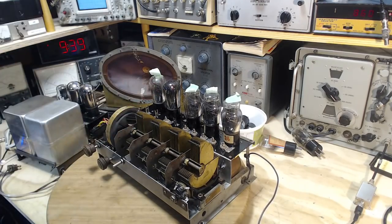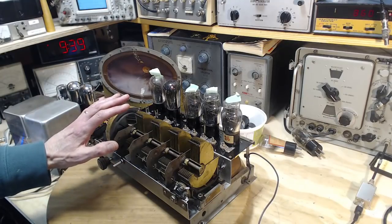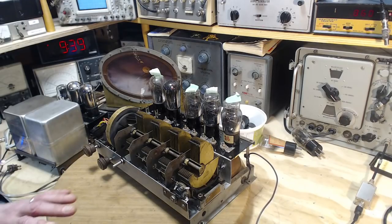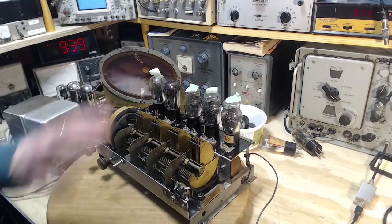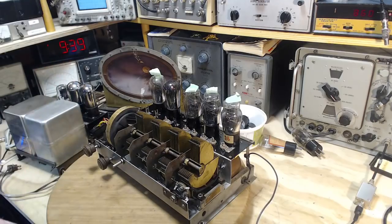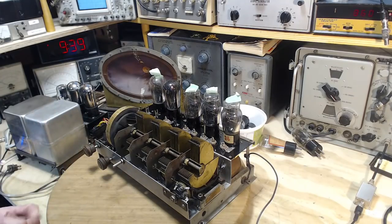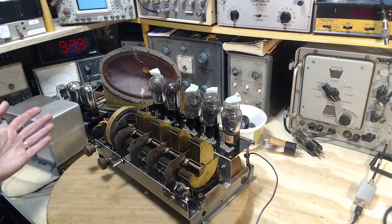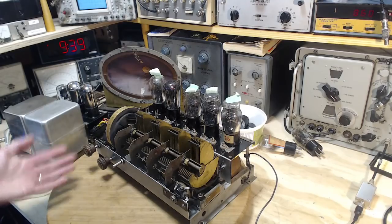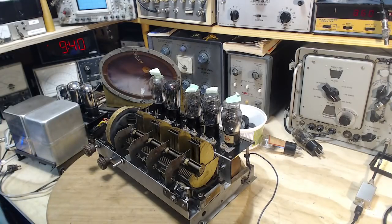So I have this radio plugged into an isolation transformer, which means it has no electrical relationship to Earth, to the ground, to everything that's connected electrically to the Earth, which is the entire electric grounding system. This thing has no relationship to it, but it's a radio receiver. It's designed to be affected by signals. So a really interesting question comes. Can this thing literally pick up 60 cycles like a radio station, feed the 60 all the way through, come out the speaker? I don't think so.